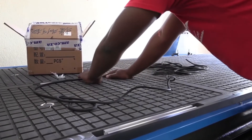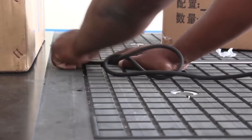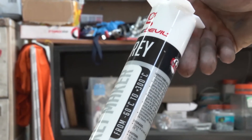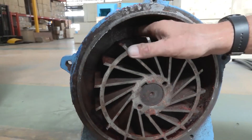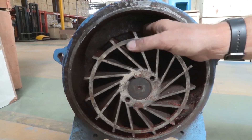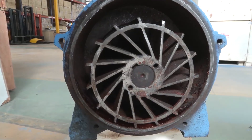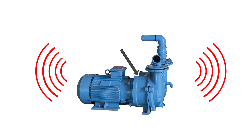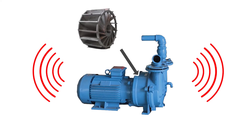The power of the liquid vacuum pump lies in its air tightness. That is why we make use of rubber cord and silicone to ensure air tightness throughout the system. This also stops any other residue from getting into the system and landing up in the impeller, which will almost certainly cause damage. The sign of impeller damage is clicking noises coming from the pump body when the motor is running, caused by the debris of a shattered impeller.